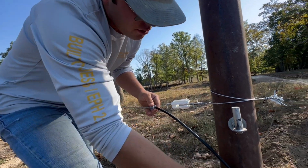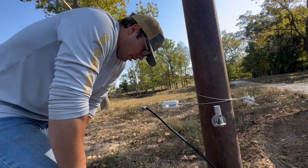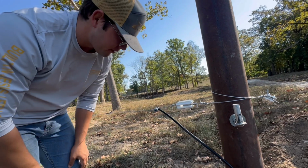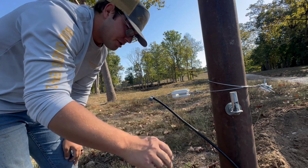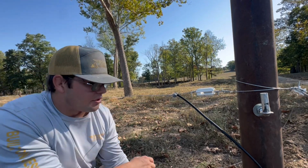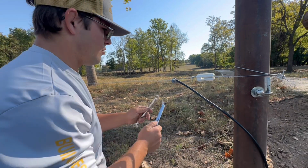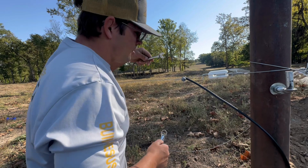The reason I hug the post is, like I said earlier, it keeps the cows and stuff from knocking it off, because it's an electric fence, they'll tear up the plastic insulators and stuff if they really can get a hold of it. And this wire actually isn't hot, only when it comes to the bare wire. This is just insulated so it doesn't ground out everywhere. So if they can actually hit their nose on that, they could rip it out of stuff. We don't want that.